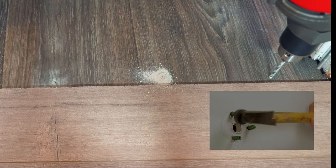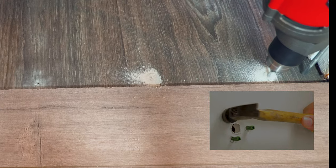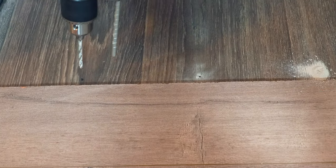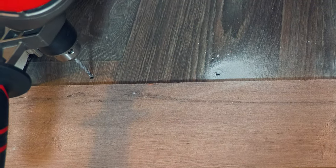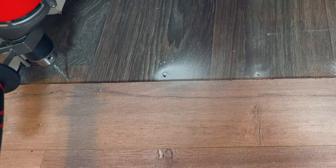If you're using an anchor, verify that the anchor fits in the hole. Don't place the screw all the way in yet, because once you drive the screw, the anchor gets bigger and tighter in the hole, preventing it from moving. But generally, if the anchor fits, the screw will fit.